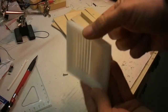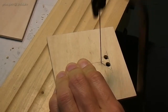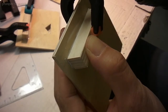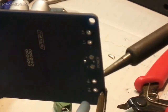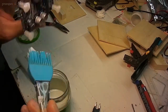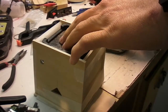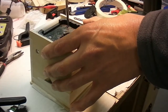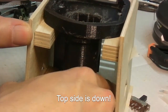So I had all the design faces cut, all the parts 3D printed, and I can begin with the assembly. First I cut the holes for the decor pieces and the audio input. I glued the holding pieces to the sides. I needed to get rid of the speaker connectors to spare some space, so I also desoldered the DC plug. To attach the electronics to the front, first I screwed all the legs to the board, then used some drops of ABS dissolved in acetone. This beveled design was a bit tricky to assemble. First I taped all sides into place, then mounted the battery piece to the bottom side. At this point I removed the back side to glue pieces on the top that will match with the sides.